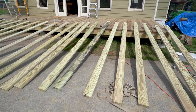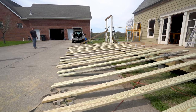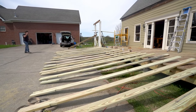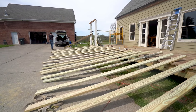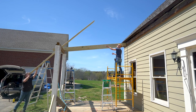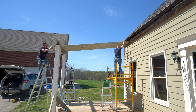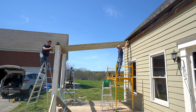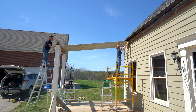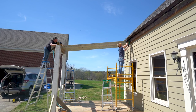Processing material feels like a big slowdown, but staging things like this makes the next step fly. With the rafters all ready and lined up, Greg and I could position our ladders and very quickly start installing them. Our system was Greg passing the tail of the rafter to me while he walked up his ladder. I would position it on the header and secure it in place. I used a spacer to determine the location for each rafter — once I pinned it, I'd move the spacer out of the way, finish securing the rafter, and then use it again for the next one.